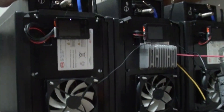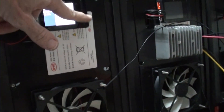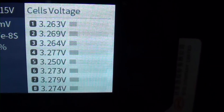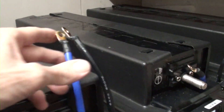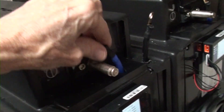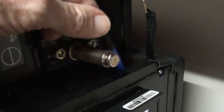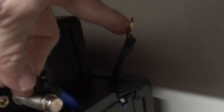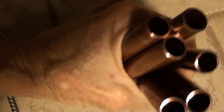Here is a view of all three batteries at this point. They've all had the management circuits installed and they're not connected together yet, so they're at different voltages from each other. There's my monitor showing the voltage of every cell in each battery. Now the heavy wires from the BMS: the blue lead connects to the battery's negative terminal and the black lead becomes the new protected negative terminal of the battery, which will disconnect if any cell is too high or too low in voltage.